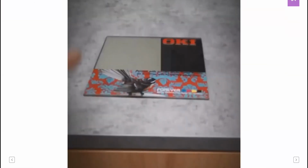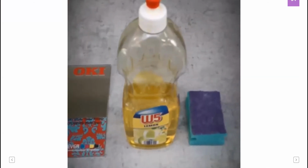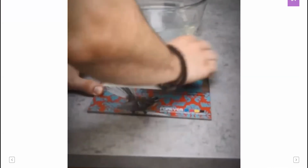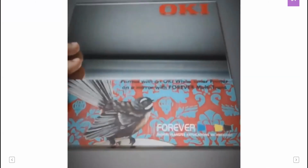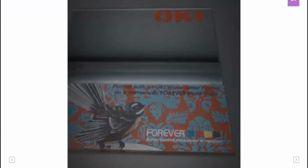Sometimes you might see the unprinted area transfer to the substrate, but just using something as simple as an alcohol or some type of washing liquid, that's just going to bring it straight off the substrate, especially on a really reflective surface like mirror. That could be quite obvious. And it is really durable, but again, it's not suitable for dishwasher because a dishwasher gets to really high temperatures. So that's the process for going onto flat surfaces.